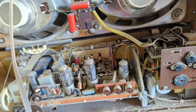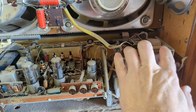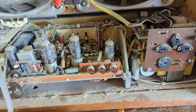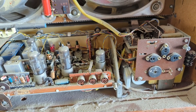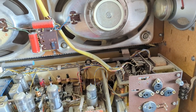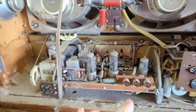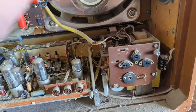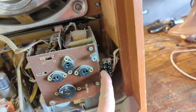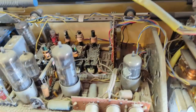What you need to do on these first of all — there are a lot of dust bunnies — is remove the two individual chassis: the tuner chassis and the power chassis. There are all these little plugs that plug in, including some that go underneath. What I tend to do is take pictures of how everything is inserted, because when it comes time to reassemble you'll forget. There are four screws holding this in. Be really careful because it's made out of really thin phenolic plastic — it's super brittle, so don't jerk or yank on anything.